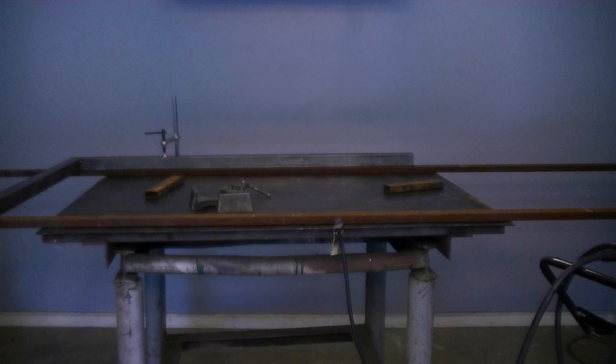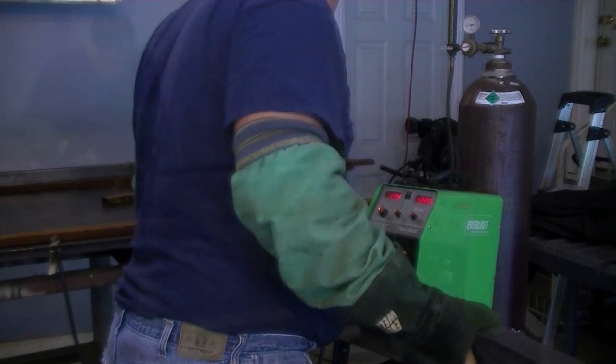Now, if you're having to build your trailer on the floor, this tubing as a base support is a good idea because it helps even out high or low spots and gives a base platform so that you can shim out any irregularities without having to affect the trailer frame directly.